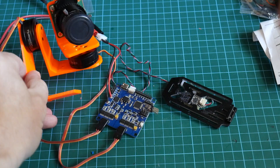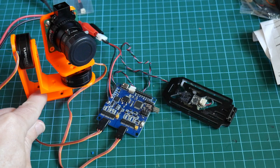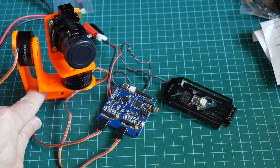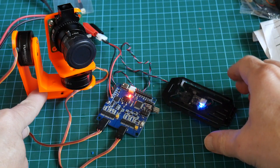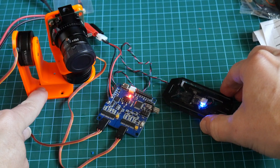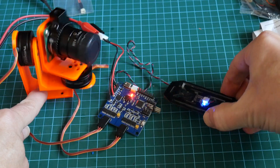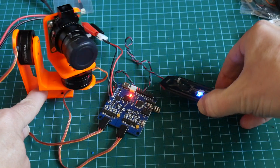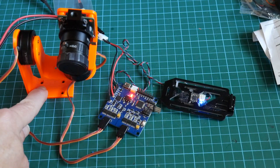Here's an early prototype of the gimbal that I plan to put on top of my hover chair. It's 3D printed — it's quite wobbly so I need to fix that. I've got the same BGC and the same code that I wrote. So again, when I move the MPU-6050 you can see it moving. It probably needs a low-pass filter on the pitch and roll because it's a bit jerky at the moment — we'll smooth that out.